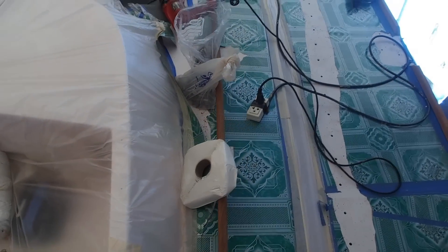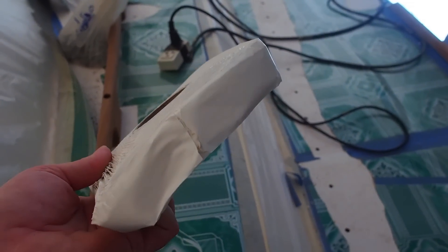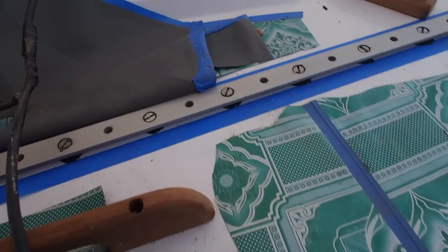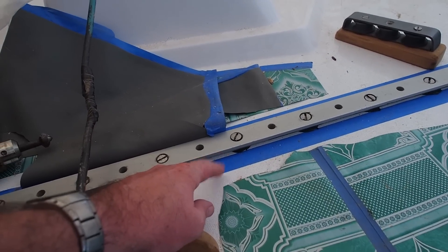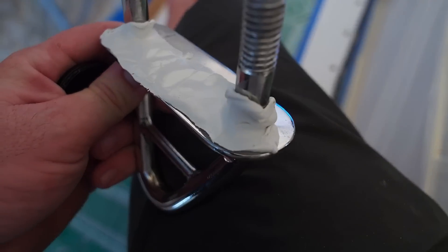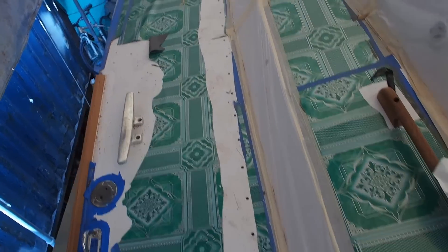This afternoon Ton and I are going to start on the butyl tape for the genoa track, and as you can see we now have white tape. Butyl tape has a tendency to extrude not just immediately after screwing it down, but actually after some weeks — and some people have even claimed after some months. Obviously black isn't as pretty as white, so we've finally received our white butyl tape. The other thing we didn't do that we should have done was run the tape underneath the entire track rather than just the heads, so that's what we're doing on this genoa track today.